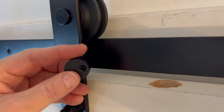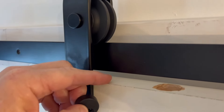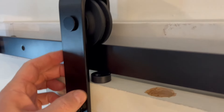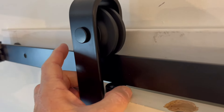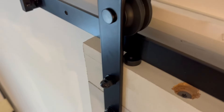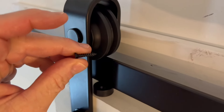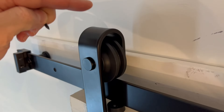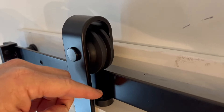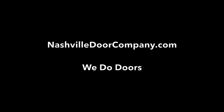This is the anti-jump disc. You'll notice the screw hole is not in the center — that's so you can install it while the door is in place. Try to get it directly under the wheel or as close as you can, then line up that screw hole where you can get to it. As long as part of the disc is underneath the track, you'll be okay. Put a long extension bit on your drill so you can get to it. Once it's in place, if the door were to jump, it hits the disc — so the wheel can't go off. Make sure this is the last thing you do.